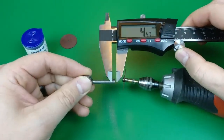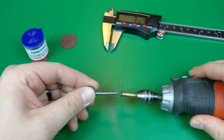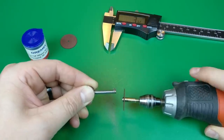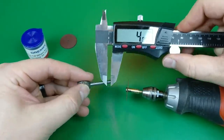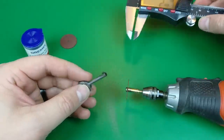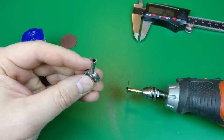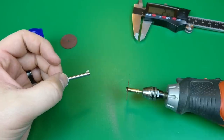She's gotten pretty hot but has she slimmed down? Yep, we're partway there. Let's keep on keeping on — remember, you can always cut a little more, you can't easily add metal back on, so keep checking your work. Look at that, pretty spot-on. If we take a look at the actual tip, which is mighty warm, we have just discovered you can see a really nice crisp edge. That's what we wanted — to square off the bottom of those cuffs where space is a factor.